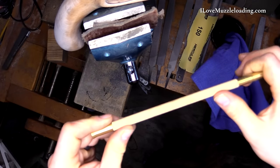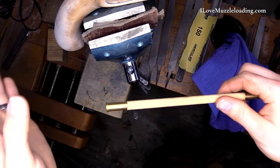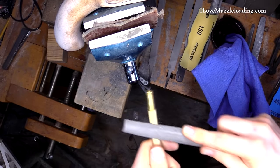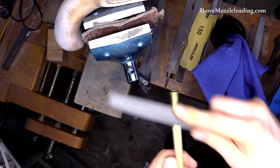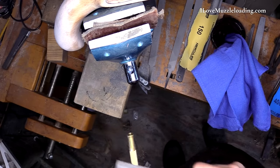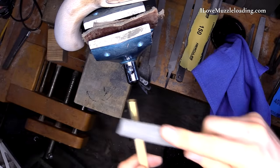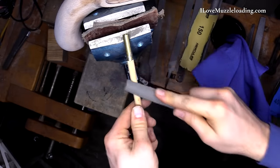The ramrod is not going to necessarily look the same because typically your ramrod is going to be a harder wood. Like here in the United States, we have hickory — that's the go-to ramrod — whereas your stocks are usually a little bit softer. Hickory is really a go-to for a strong ramrod. I'll just kind of hold it in my hand and run that file back and forth, rotating it as I go. Then I'll kind of taper the entirety of the rod.